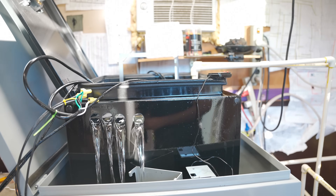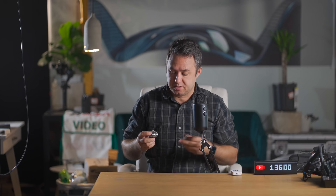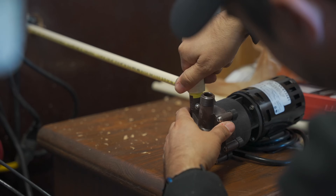To simplify the design, I bought a big steel cube and then put a smaller but taller steel cube inside of it where the miners will do their work. I cut some circular holes in the outside of the tank and then bought these little ports that screw together and clamp down. They have half inch NPT threaded ports that I could run CPVC out and down to this chemical pump. This pump is on the approved list for Bitcool, and I was curious to see if half inch CPVC could move enough fluid to keep up with two overclocked S19J Pros in one tank — spoiler alert, it can.